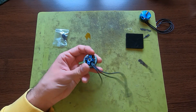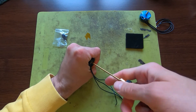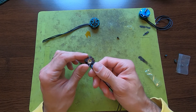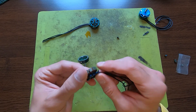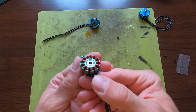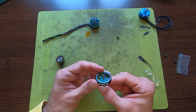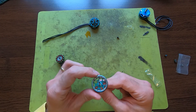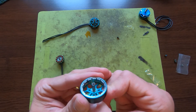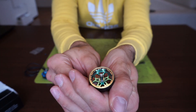So let's disassemble the motor and see if it's your typical iFlight motor. We have the standard larger-size bearing on the bottom. Pretty nice and clean, with thin lamination and multi-strand wire on the stator. The bell has that lip and outer and inner ring. And what's pretty interesting is the little cuts inside the magnets.